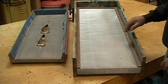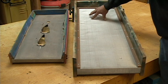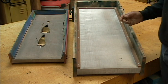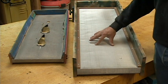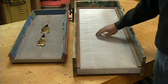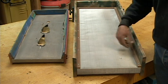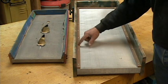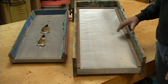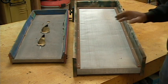These cross braces — you can't see them down in here, but they're all held down below, so these two tracks are the only thing the screed will run off of. We're not going to use a wood screed this year. On these two main runners underneath, I cut a series of grooves all about three-sixteenths of an inch deep. That prevents water from just running all the way down — when it hits these grooves it branches off and goes down. I'm thinking I'm going to run this box completely flat, no pitch. You can't put enough pitch on it to make anything come off the box without getting it so steep that the water won't go through the screen.